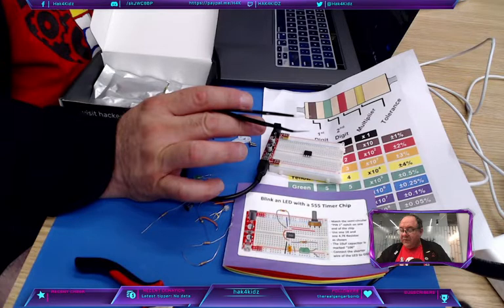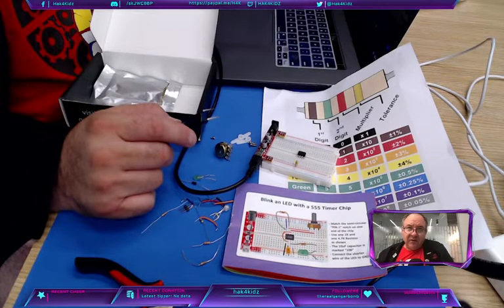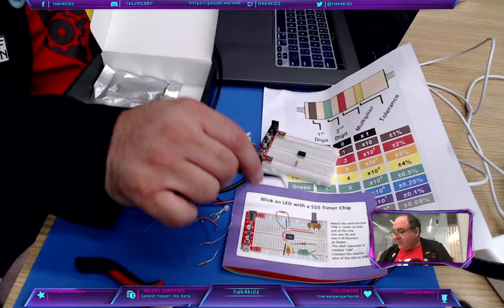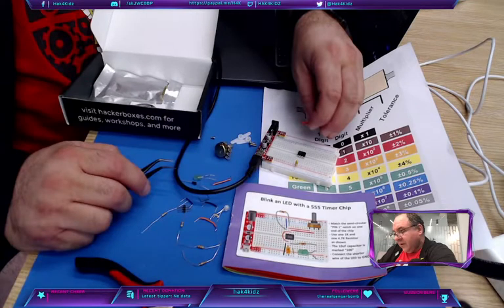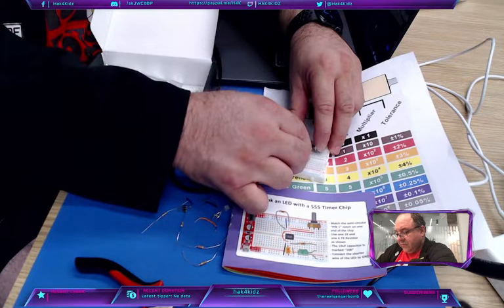All right. Next one. Let's do some other wiring, because that's really simple. And you can see the color-coded wire. Try to find the one that matches, so it's easier for you. We've got a red one that is on pin 6 that goes to the potentiometer. So I'm going to grab the red one. I'm going to straighten it out. It's a little bent from the other project I did. I'll fix it. And it goes from pin 6, right here, but it's one up, one away, because we've got another wire that needs to go in there. And then keep it straight and go straight down to the other side wherever it reaches. And it should look like that.